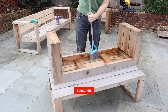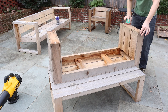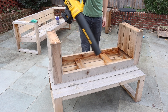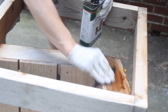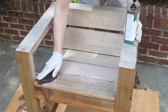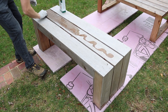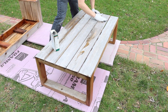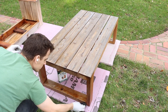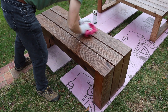The finishing process is pretty easy. You just use a broom or brush to get any excess dust and debris off, then use sandpaper to do some light sanding. You're not trying to take away too much because you'd lose the patina, but you want to get rid of any burrs that could catch on your sleeves. Then dust things off. For the teak oil, you put down a really heavy first coat and let it soak in for a while. If the wood is older and drier it'll absorb more oil, so you want to make sure you really saturate it. After that first coat sits for about 10 minutes, come back with another coat to cover any dry spots, let that sit a bit more, then come back and wipe it down. And we are done.